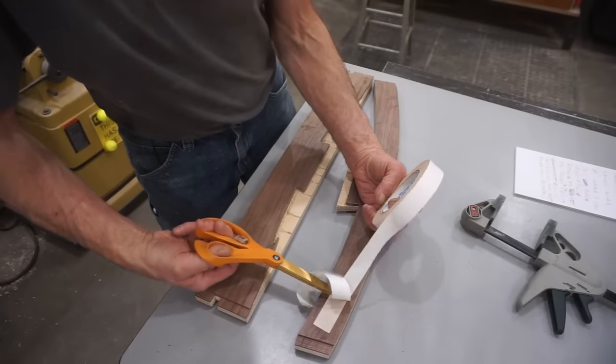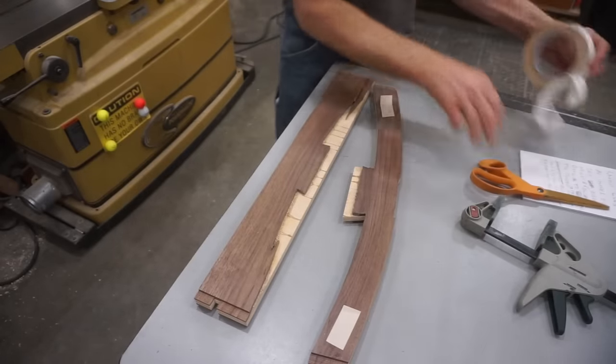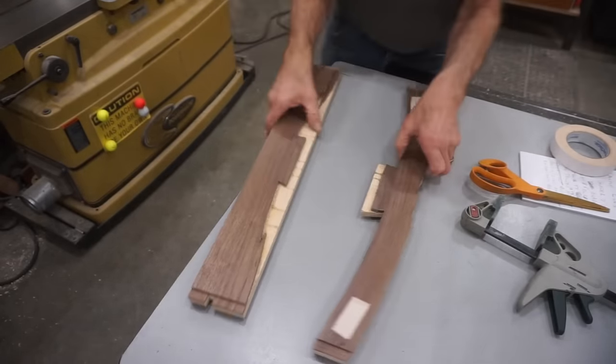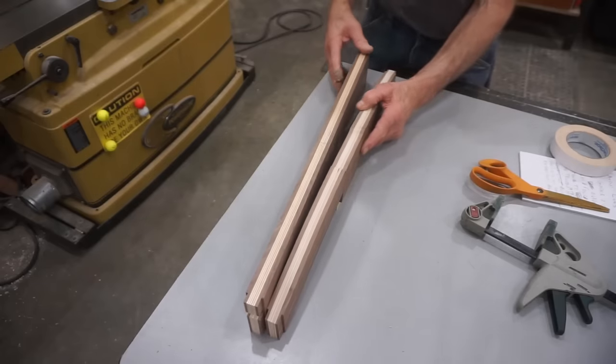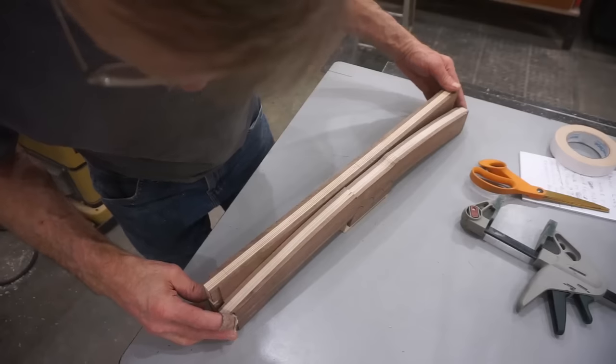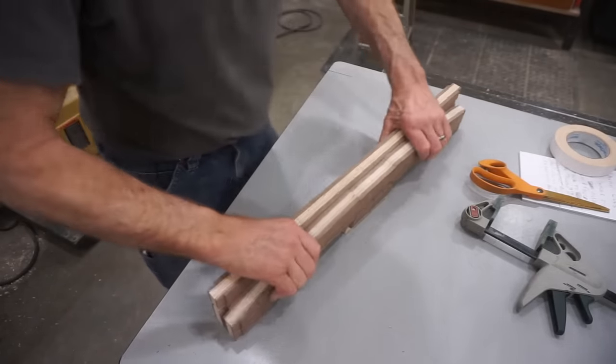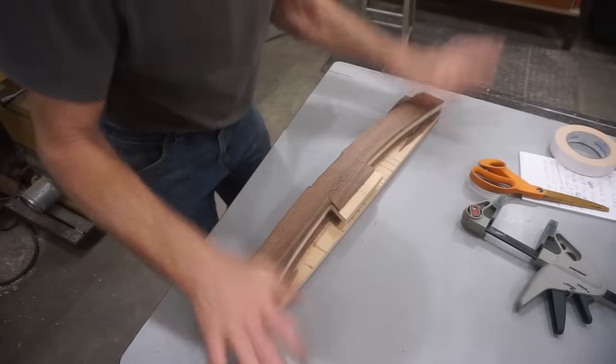In case you're wondering how I dealt with the handle cut prematurely on the bandsaw, I'll show you this little sequence where I use spec tape to attach the cut blank to one of the full blanks so that it's oriented just like it needs to be, and I can run the blanks that are stuck together through the setup on the table saw to cut the tenons on this piece, even though it doesn't have full parallel edges on it anymore.